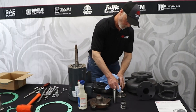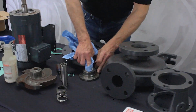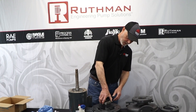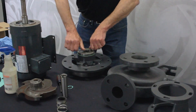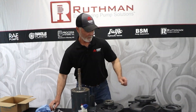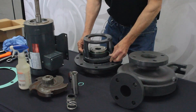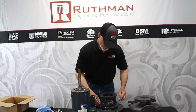You want to wipe off where you've touched it. A lot of times we'll use alcohol to clean any oils off your fingers. Put a new gasket on and then mount it back in the stem plate. Make sure you tighten the bolts evenly or it could possibly leak. Then put your stem on your stem plate and bolt that down. Note these are slotted so you can level your housing once you get the pump together.